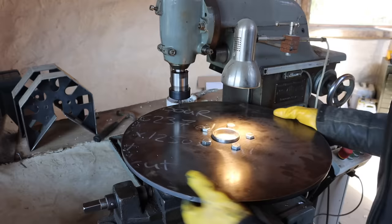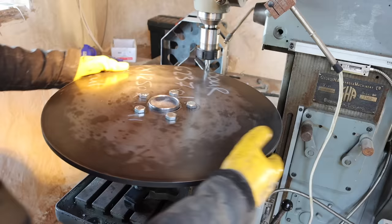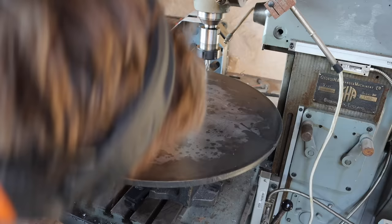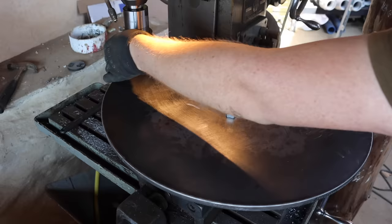Kind of dodgy, but this is a big lever. I've got quite a lot of control, and the stop button's there. I'm ready to hit it. I can't get it on the lathe this big unless I take the gap out. I don't really want to do that, so we'll go over this. So we're doing it. It's getting a bit dodgy with the end mill because it'll grab, but a little burr shouldn't grab so much. And even if it did, it'll break or bend. So we'll do it like this now.